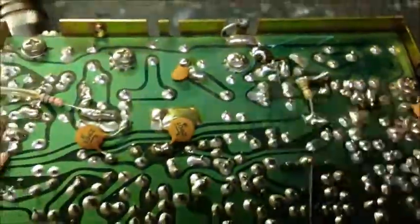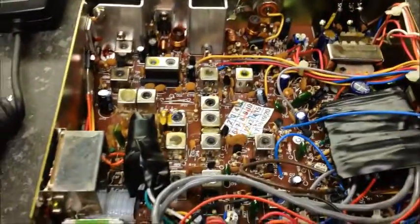I've already got the screws out and the lids off. It doesn't look like anything real special — looks like your normal Cobra 29 swing kit. There's the resistor, pop it open, you've got your capacitor on the other side, a little swing kit. They've clipped the limiter, which is down there, so it's nothing extravagant. But there is an echo board in here — I don't know why somebody couldn't have mounted it, but they taped it all up. Normally if I do echoes I try to mount them and not do all that black tape. We'll be back with an update — we're going to tune this one up and get her going.